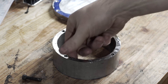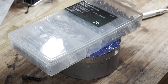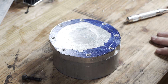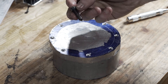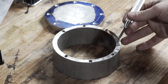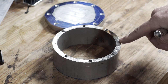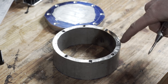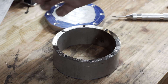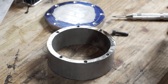That sucked — about two hours of misery. I drilled and tapped this top plate for #6-32 because that's what I had on hand, without matching metric taps or smaller hex heads. But immediately when I started to tap it, I broke my tap off. I pretty quickly realized this just wasn't going to work — I don't have a sufficiently rigid setup to do that small a tap in stainless. So I went ahead and drilled out the rest of the holes for 1/4-20, which are spaced a little better so there aren't as many edge breakout issues.